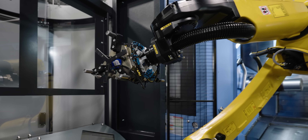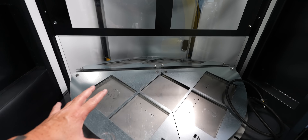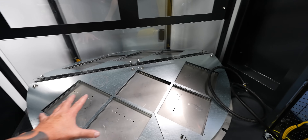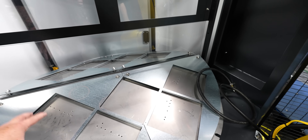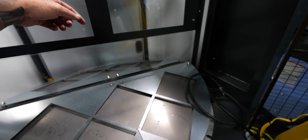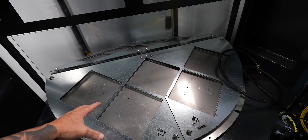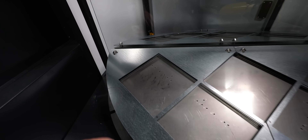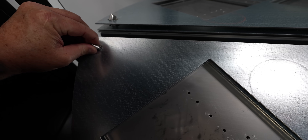It's also really cool — if you look, it's super simple. Just like a horizontal mill with pallet systems, this serves almost like a pallet right here. It rotates: when all of these pieces are done, it rotates 180 degrees, that door opens and you can place more parts over there. This one right here is set up for five pieces per side. And you can actually rotate these holders — see that? — and then this thing comes up.